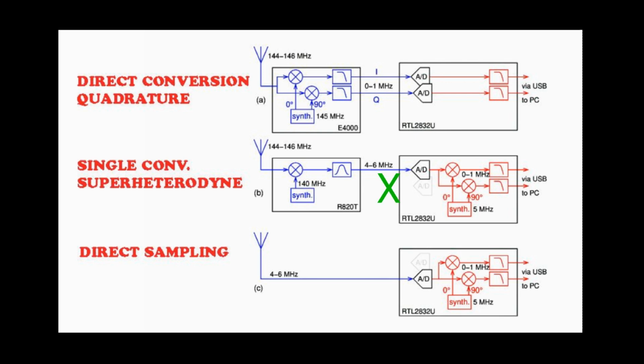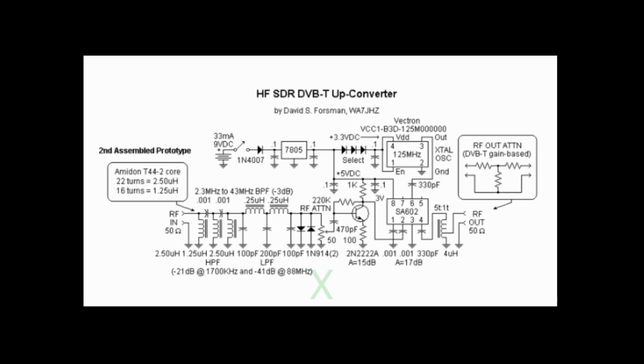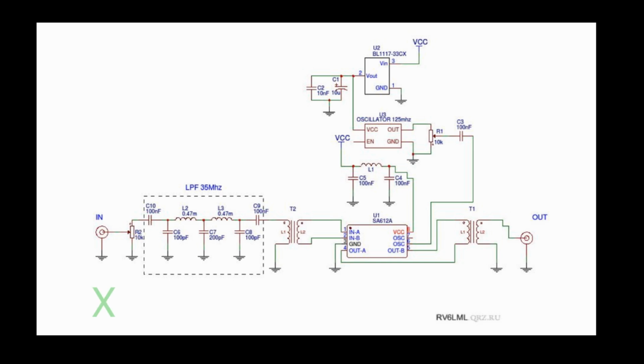That's a good thing. But despite this filtering, there is still the problem of weak versus strong signals that are within this passband, not to mention the fact that it doesn't take a lot of signal to overload the R820 outright. Of course, attenuation is one way to reduce the offending signals to the point where you're still in the linear conversion range. What happened to my weak signal once I put an attenuator right up at the antenna? It's gone. Here are a couple of approaches. Here's how we could handle this weak, strong signal problem.